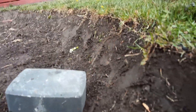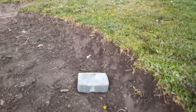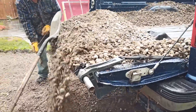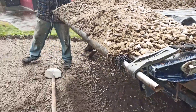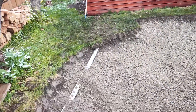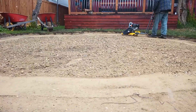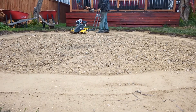You've got to get a base in there — whatever is recommended for your area. What we have here is crushed gravel; it's readily available and packs really well, especially when wet. I also put a conduit in — that's not necessary, but it's something the client wanted for water or electrical out to the patio. It's a good idea if you're putting something in.